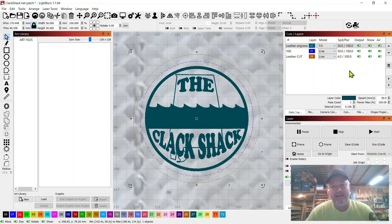That blue line is basically just a scratch line — I'll explain that in a minute. For the leather cut I ran four millimeters per second at 100% output. Leather is tough — it was harder to cut than the four-and-a-half millimeter wood I'm used to. I wanted a really clean cut so I didn't have to do any trimming, so I ran that for five passes. All of this is done with my air assist on; I run it whenever my laser is running.